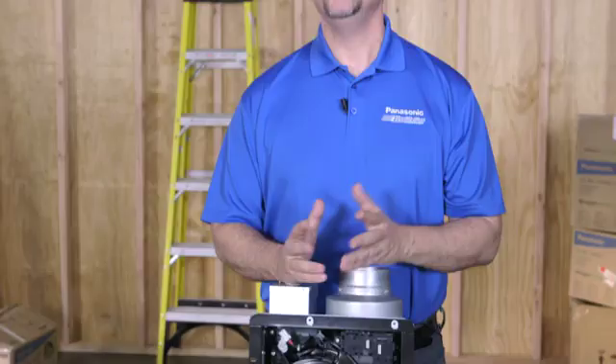Please note, you will need to adhere to and obey all local wiring codes. When using this method, it's important to note that if you choose to add any plug-and-play modules at a later time, they will only work if the wall switch is in the on position. Otherwise there will be no power to the fan, so any modules would be inoperable if the fan were in the off position.